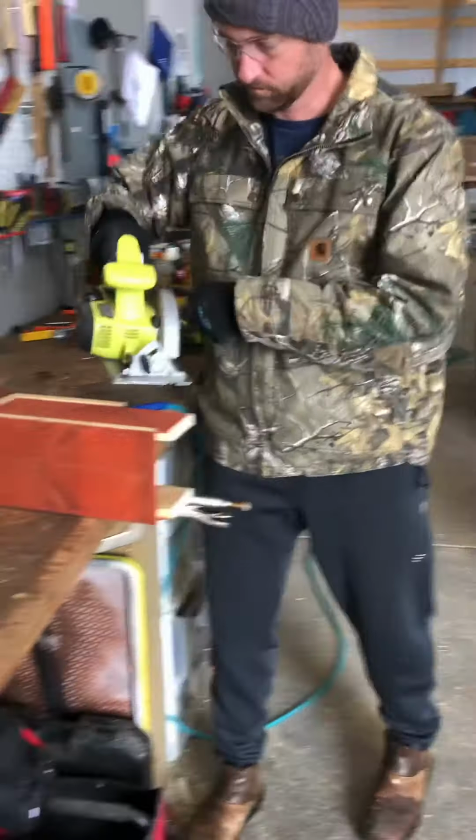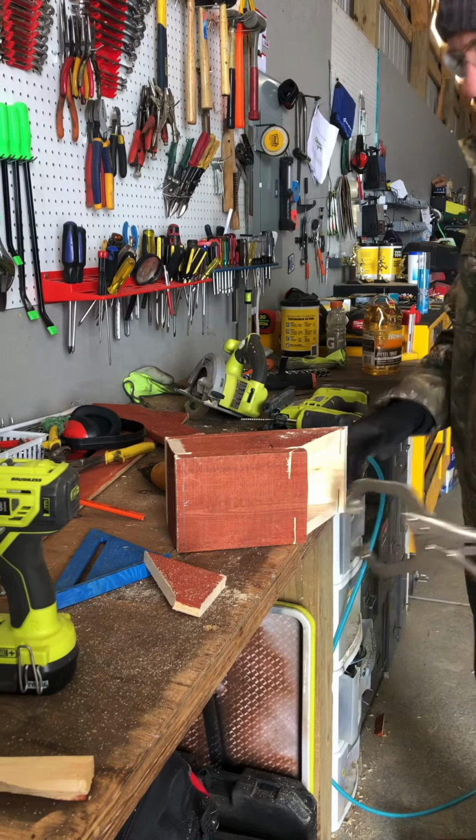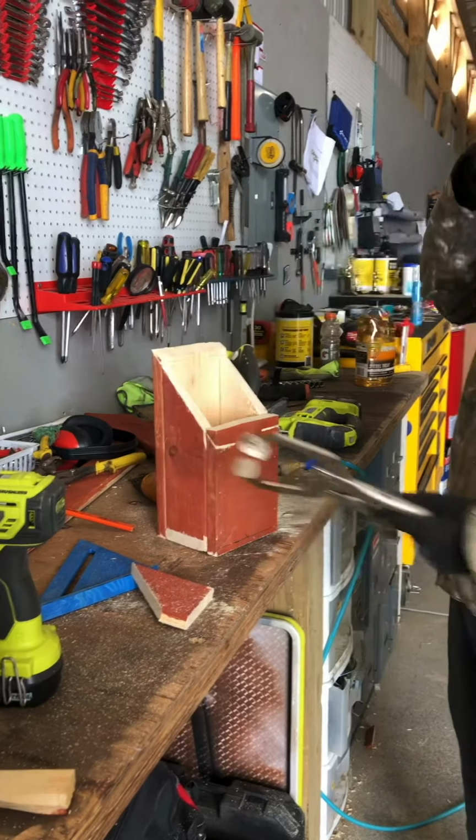So, that's about all we can do with the circular saw, and then it does create a little bit of a... we have to either finish that cut, but I think what we'll actually do is take a piece of our tin, just so we give these birds a nice weather-tight seal out here. We're going to transfer these ridges into the top of this, and then we'll cut that with a jigsaw. So we'll be back.